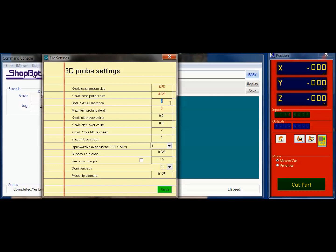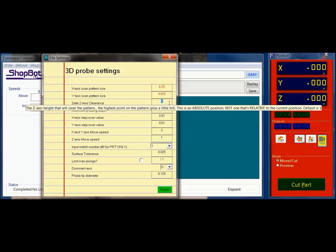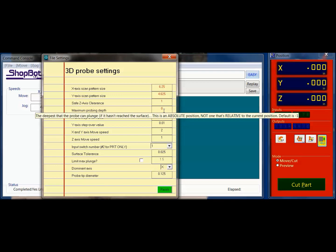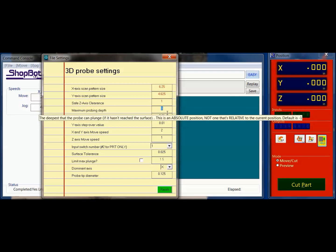What this is going to be is how high the probe picks up between every single clearance. So I usually leave it with right what it says is the default 1. Sometimes you'll see people set this smaller just to save time. Again, the probe is a matter of just playing with and getting it the way you want. Maximum probing depth is where I keep this one at 0, because what we did back in the previous video was you saw that I zeroed that probe stylus just up above the spoil board, and you'll see when we start probing this in the next video that I'm not going to be going below 0 for probing, so it's going to save me from picking up all those points of it probing the spoil board.